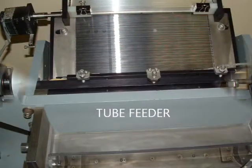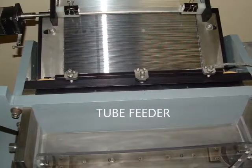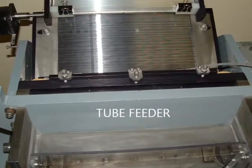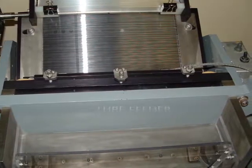The tube transport system rolls the tube under the mylar holding sheet. This system rolls the tubes past the diamond blades, cutting inward towards the inside diameter of the tube, minimizing chipping.